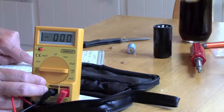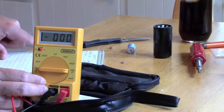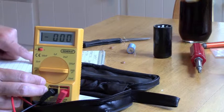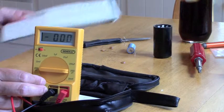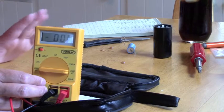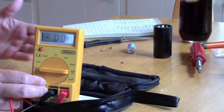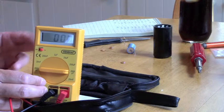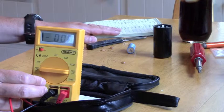A 0.001 µF cap: Agilent read 0.00131 µF, General read 0.00108 µF. The last cap was a 330 picofarad: Agilent read 354 pF, General read 325 pF. You can see there's really hardly any difference. Granted, the Agilent is much more sophisticated and does many other things, but if you just need a cap meter to check values and determine if something is good or bad, the General Instruments meter is pretty accurate and good enough for home use.